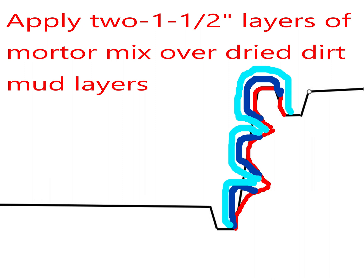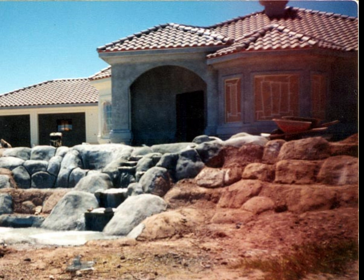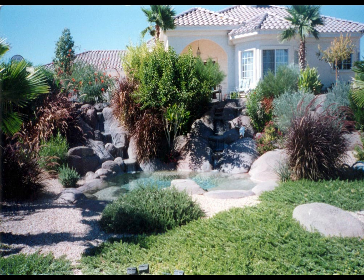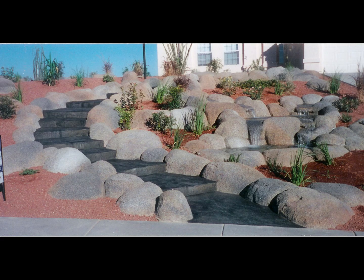It's stunning — not like what you're seeing in the video I just shot. I've built out a lot of dirt mud rock and built it to where it looks pristine. My only task then, using a three-sand, one-cement masonry-cement mixture, is to cover it with a one-and-a-half inch layer, let that dry, then cover it again — so I have a three-inch layer. There are mud formulations we can use and thin that down, but this method worked on hundreds of jobs. Saving money by using the dirt as a mortar to build it out — it's just like trash bags or cardboard rock. It's not the form underneath; it's the shell overlaying it. When you put that dirt mud on the bank and it dries, it's still there — it's still a foundation. It works.